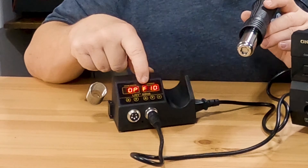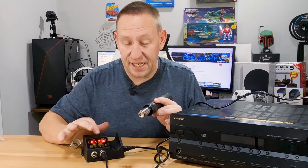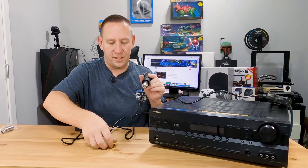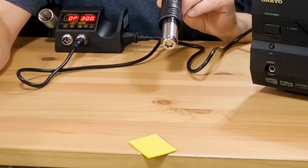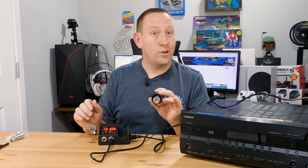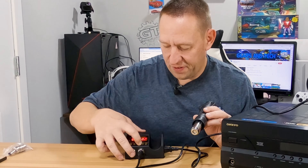You can also press this button and it says F10 — that's a fan setting of 1 through 10. Most work that you're going to do, you want the fan to blow at about 50%, so in this case it would be F5. The reason you don't want to go too high with your fan speed is if you get too much fan speed, it can blow your surface mount IC or resistor right over. This one doesn't have that high a fan output, but it is high enough that it could absolutely blow components around. If it ends up being too much, just press the fan button and turn it down to fan 2. For the repair we're doing today, fan 5 will be just fine.